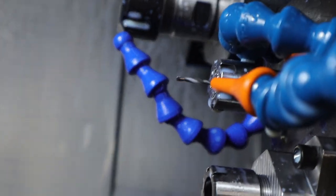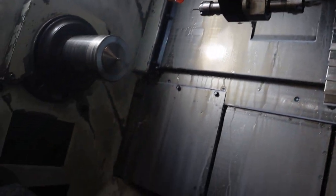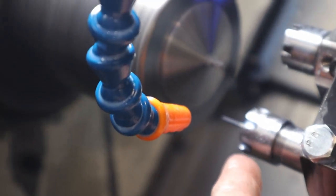So it's a 118 degree carbide 5/64th drill, and it should be 135, but that's just what I had on hand, because it walks a little on entry, and I think I have it centered as best as I could, but if you guys are going to be able to see this. Not really, so I'm just going to put the coolant on, but imagine it's drilling a hole. So now we have a hole drilled in the center, and then the tap is right here.